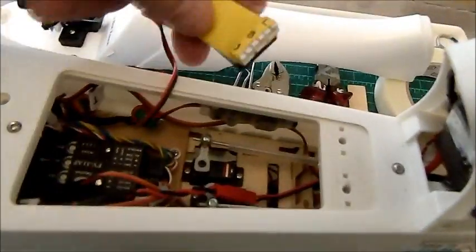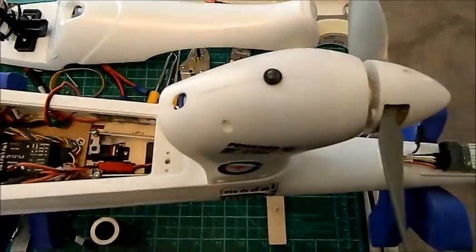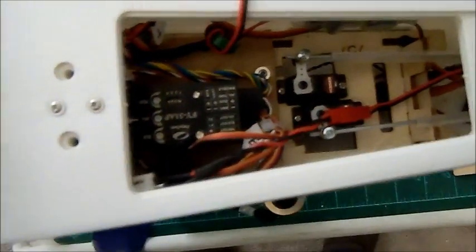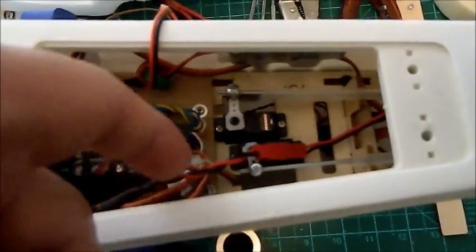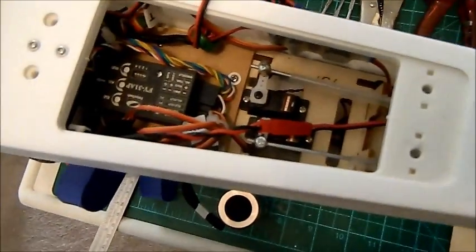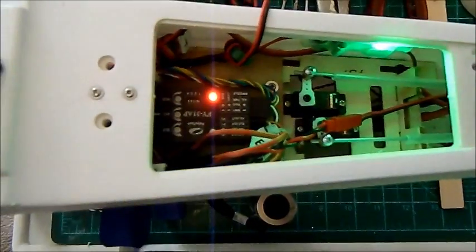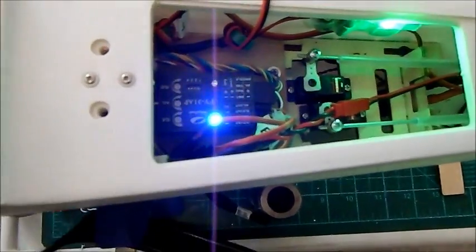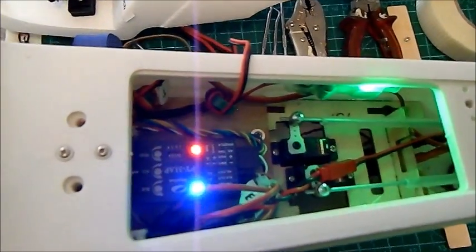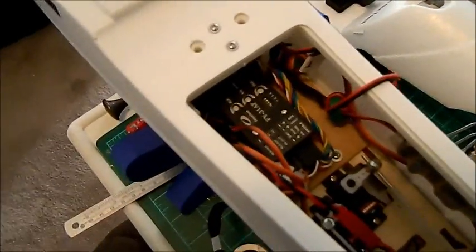Just removing this — this is actually the lighting module, because there are lights on this. There's a beacon up top and underneath. In the wings I've got forward-looking LED spotlights and strobes, as well as navigational lights. You'll see the power cable — the red cable here — especially the power cable for the transmitter. That won't be left in that position; it will be tucked away underneath. This switch up here controls all of the receiver, the FY31 AP, and also sends power to the UBEC, which supplies the lights and the receiver. Basically everything is in a nice neat little nest there.